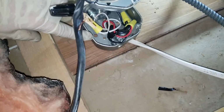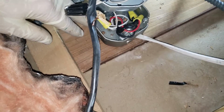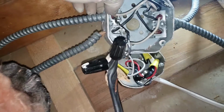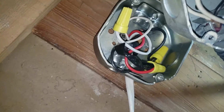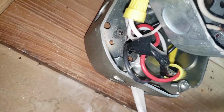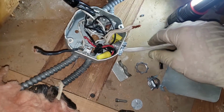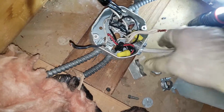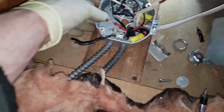Before we moved in, the fire marshal didn't pass the house because there were no smoke alarms. So someone, in a great big hurry, slapped this other junction box to replace it. The one down below that's barely attached and is definitely not to code and just has hanging wires, that's where the new smoke alarm is. But regardless, I removed the new junction box and secured the old one and routed everything through it nice and securely and buttoned everything up.